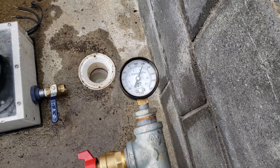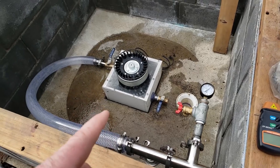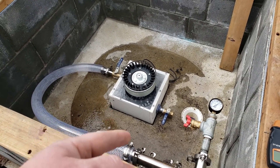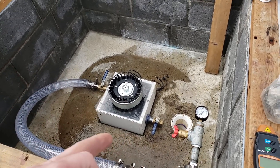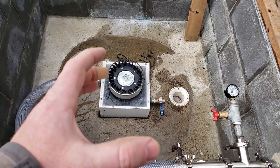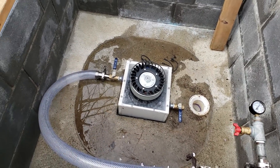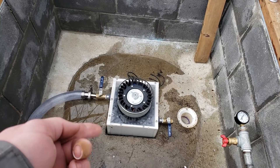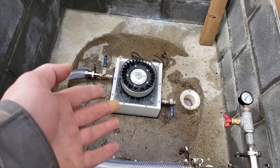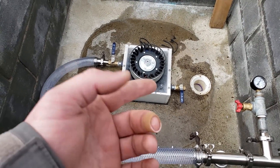Okay, 2700 RPM. It's certainly worn in a lot — when I first set this up with that nozzle it was doing like 1800 RPM open circuit, so it's worn in a lot. I need to get a larger runner to slow it down because I'm getting a lot of friction from just being at such a high RPM. Chris Harbour said that his is operating somewhere under a thousand RPM, like 800 RPM, and this would want to operate at much higher RPMs, so I need to adjust the runner on version 1.0 to be larger.